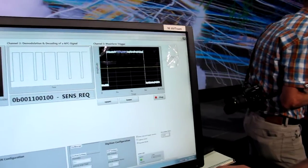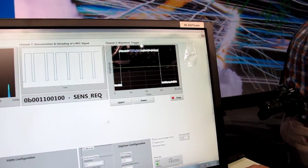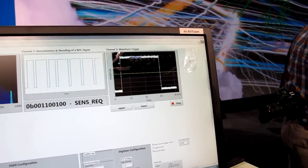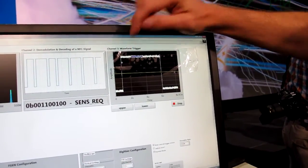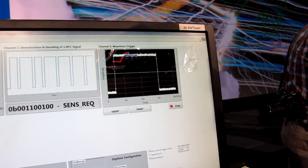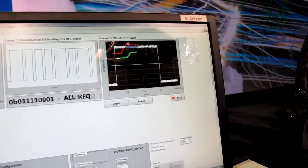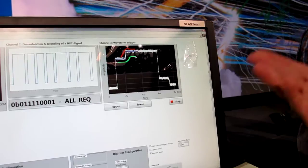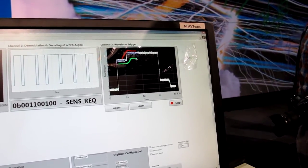So was it just an analog trigger? Was it just an edge trigger? We cannot catch our signal, but there's a small glitch in that upper left corner — something going on here. So you're just drawing high and low limits right now? Yes, right on the screen. Whenever the signal is passing between them, we trigger and capture it. That's amazing.